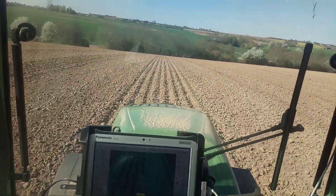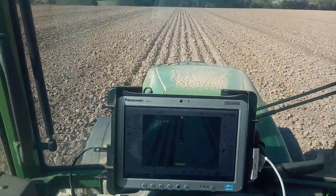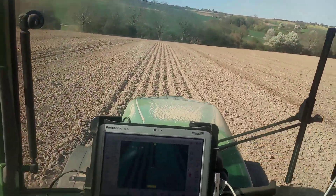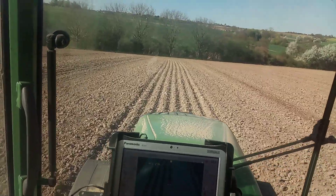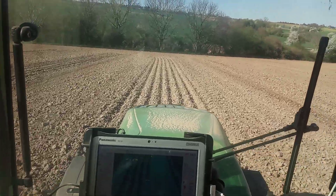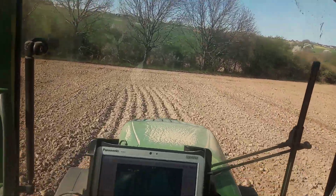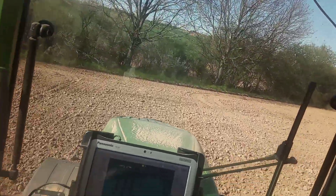If the tractor drives on rough ground and wiggles left and right, the dual antenna system loses the relative connection and you don't get any heading at all. We used the heading from the single antenna and mix it with the dual antenna and limit the maximum change according to speed. The maximum changes are configurable in the web interface, and now it works pretty good.